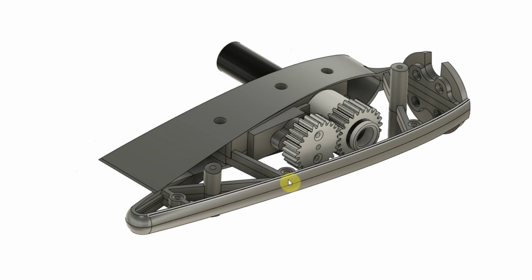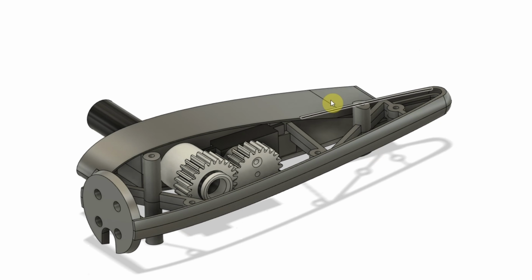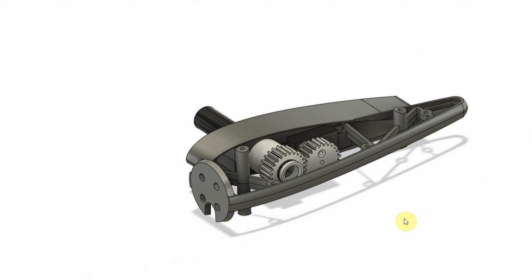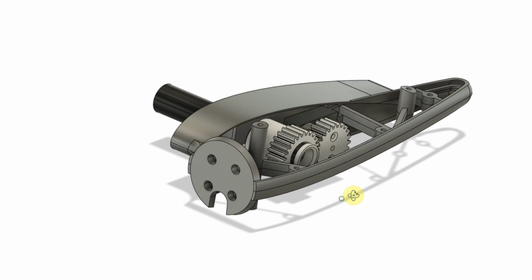And then I'm using three very small, 5 or 6 millimeter long, 2 millimeter flathead screws that join the top and the bottom, and really make this act as though it's one piece. I'm amazed at how rigid this is once it's assembled. This printed piece here is about 17 grams. So we've gone from 50 grams down to 17 grams, and I couldn't be happier with the way this has worked out.